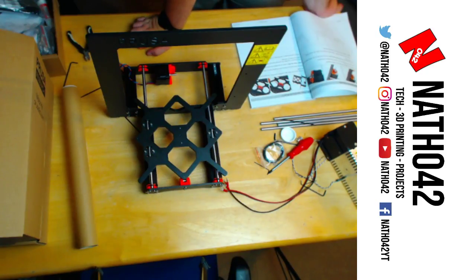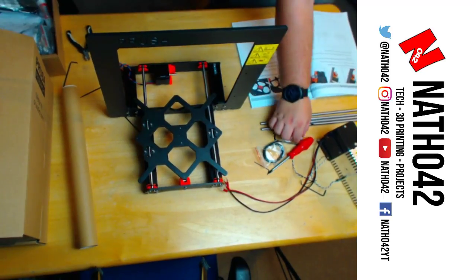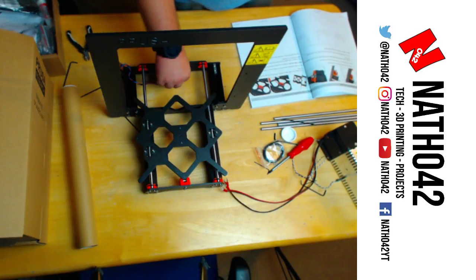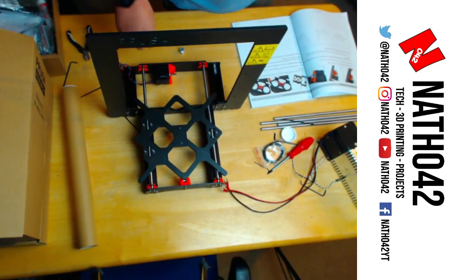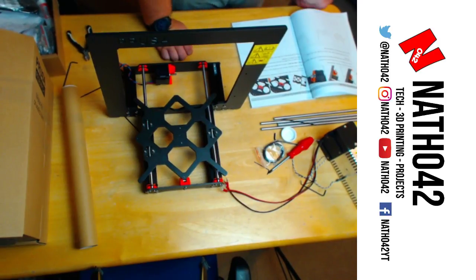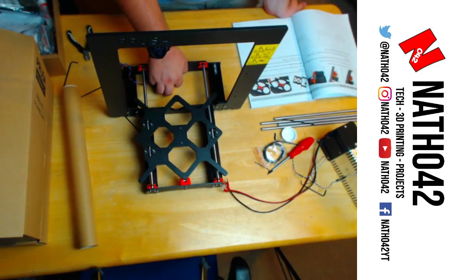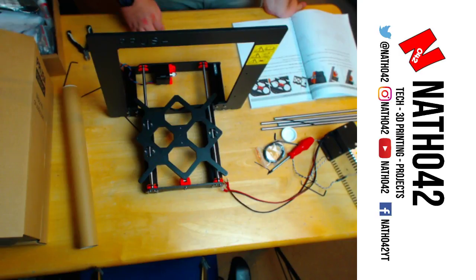There is a flat part on the motor shafts. Rotate it upwards. Okay, yeah. So from these pictures, we're going to be putting this on. So we have this one here. We want to rotate this so that the flat part is upwards. There we go. Place the pulley on the Y motor shaft as shown in the picture, like this. Ooh, quite far down as well.